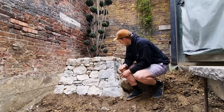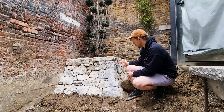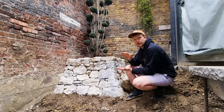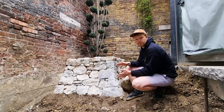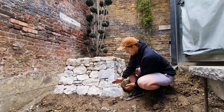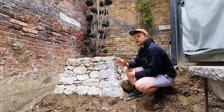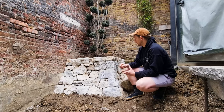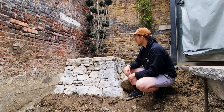It was pretty difficult to get our head around doing this corner at first, because unlike when we're normally building a corner where everything is dead flat, these quoins lean back both ways. This one is leaning this way and that way, and that's an element of this technique that gives the corners strength — totally counterintuitive really, but it gives a striking look.